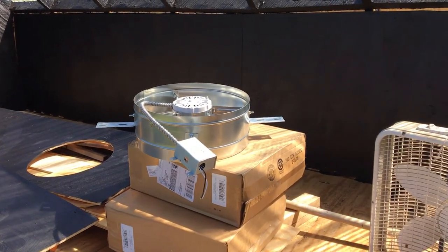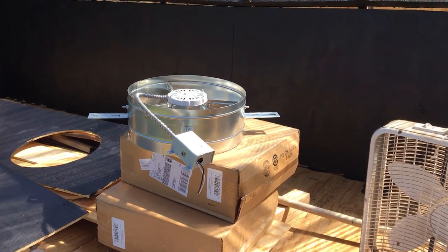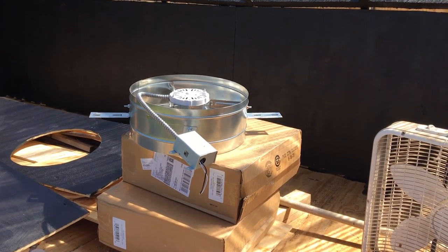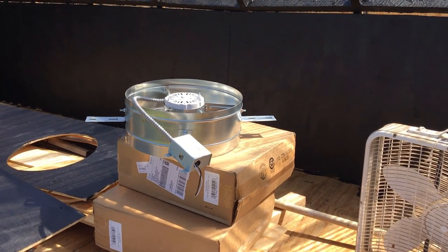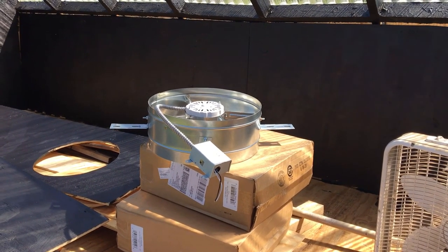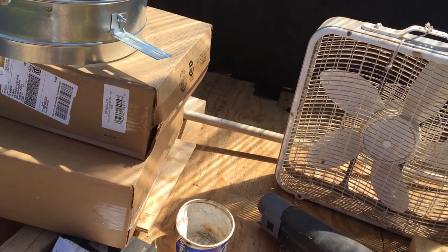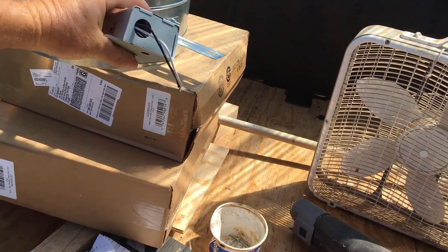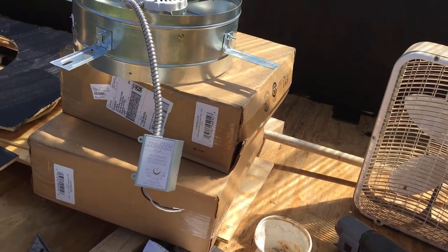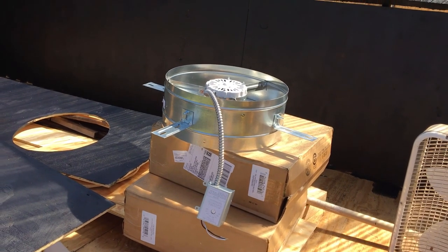As far as the fans, I went to the big box store and you could buy replacement electrical cords for your skill saws, your drills, what have you. And so I'm going to wire those in to the fan. Now, the wires you see hanging out there, I will take it apart and see if there is a ground wire inside of the thermostat. Yeah, there's a ground wire, so I could take the cover off of that, go ahead and hook the ground wire to that cord. That way, if any time I need to unplug it, replace one, or just whatever, I can certainly do that.